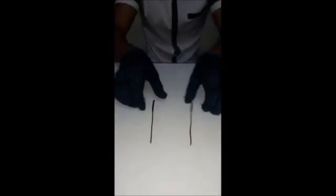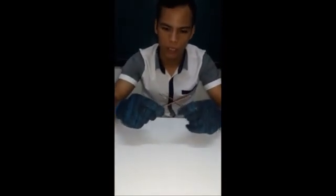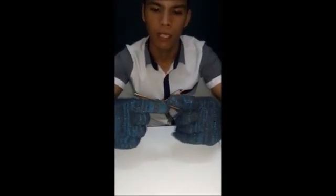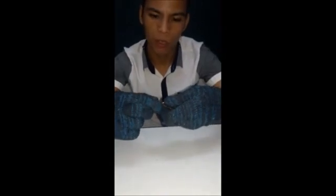In doing the Western Union short splice, we need two straight wires wherein the insulation was removed this way. Then put the two wires in a cross position, mid-halfway of the insulation. Then twist it about two to four times.